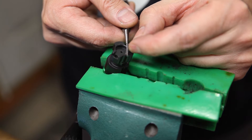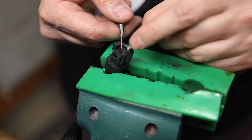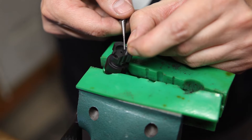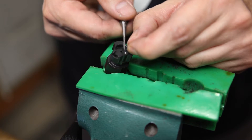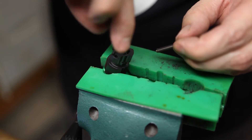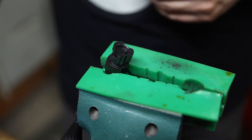When reinstalling, you want to make sure that you reinsert this ejector straight. You don't want to have it canted because as you push that pin through, you'll start chewing at the edge and it's going to bind things up. Be very cognizant of keeping this thing in line. Pull that out — a lot of times the spring will come with it; if not, stick your punch down there and scoop it out. Set those to the side.